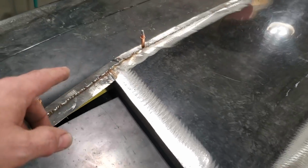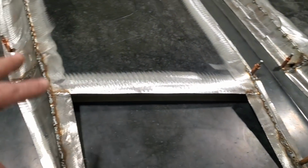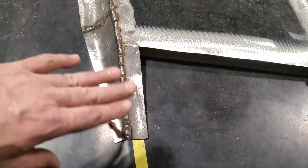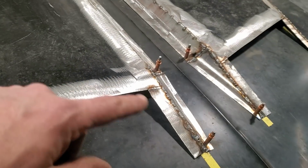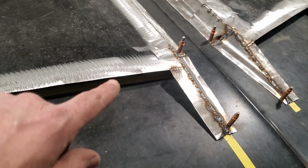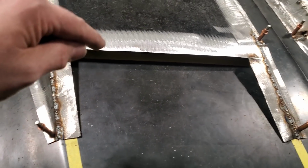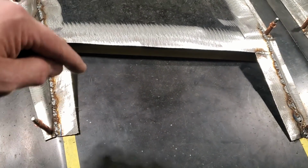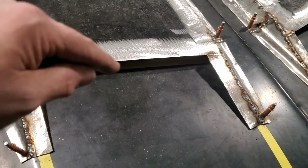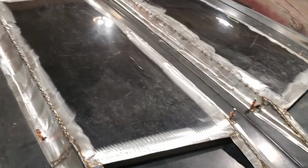And I came over here and did the same thing with these ones. Now I'm going to leave all this alone and not do anything else with that right now. I'm going to take this off and weld this up on the inside and get all this dressed up so I can get this looking proper out front, so I can trim this up here and put the last piece in, which is the front section that rolls around here. There's about a quarter inch lip on this side as well, coming down across the front of these. So I want to make one piece to go right around here, same way, a large piece, just wrap it right around like that, then I'll weld it on all the way around, grind it, dress it, and then trim off what I don't want on the front of it for the opening for the scoop. So let's get that done now.